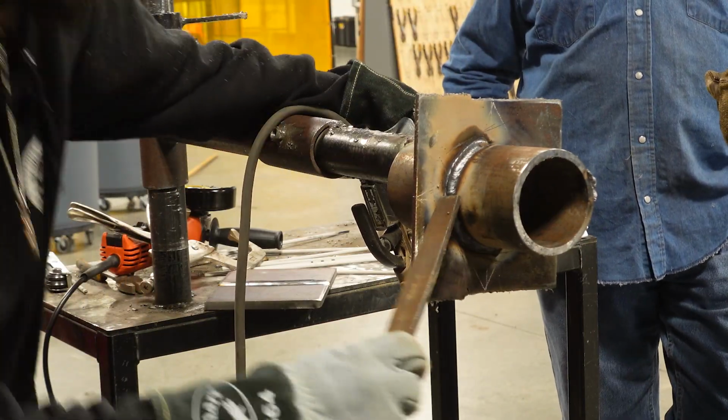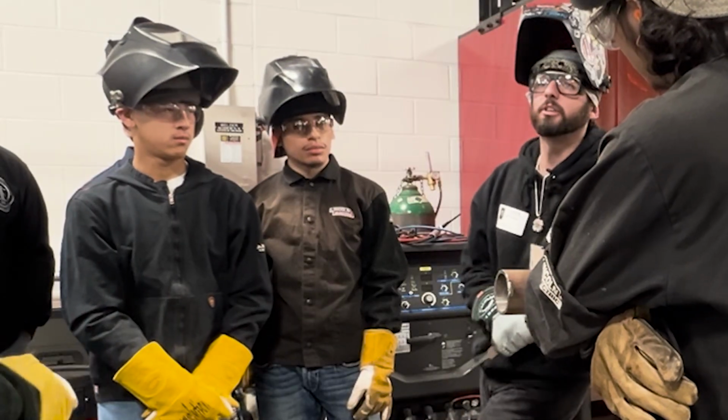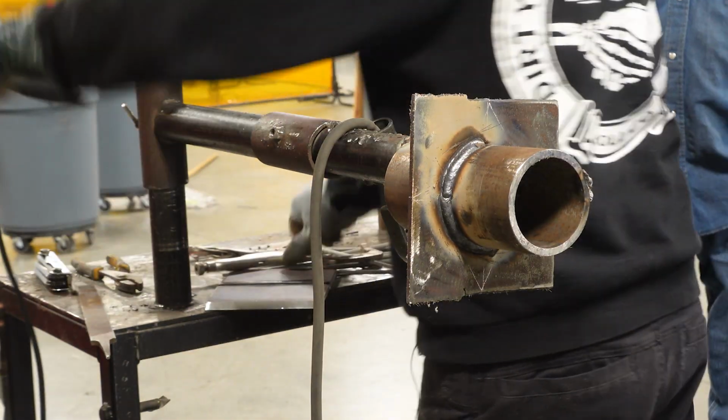And you can see these tie-ins a lot easier too. You can see that that is a lot, I don't love it, right? That's one reason why I would choose a 3/32 to do this job than a 1/8. Now I'm gonna show you what happens if we do grind this bottom tie-in.